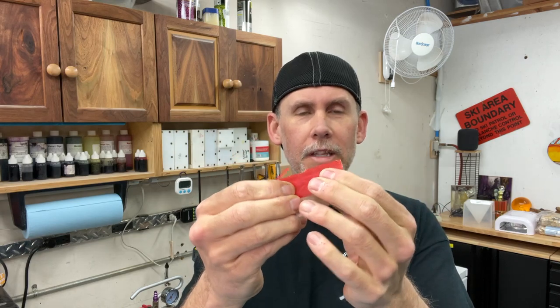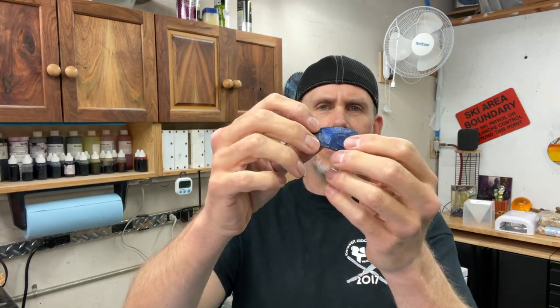Similar to the urethane tests, this is very rubbery — it literally feels like rubber at this point — but it doesn't appear to be dissolving. I don't think there's any real mass gone, but it's kind of hard to tell. It's kind of disintegrating, especially this purple piece; it's cracking and falling apart. So after 24 hours, I don't think it's dissolved, but it definitely has been affected. I'm going to pop these back into the acetone jar and leave it for seven days, then come back and check.